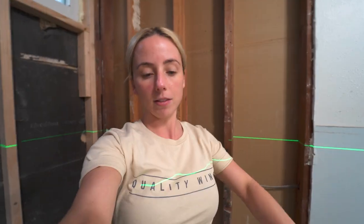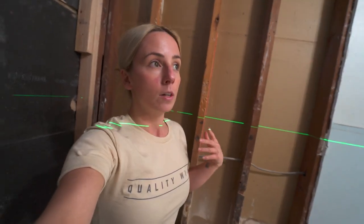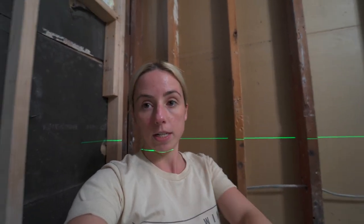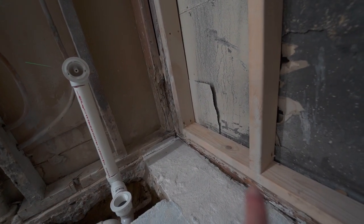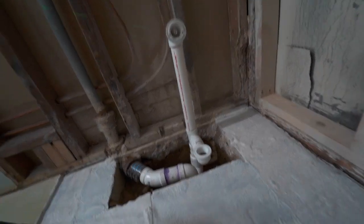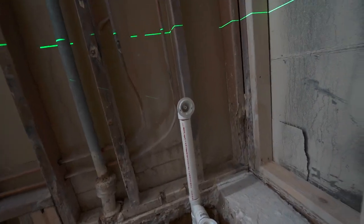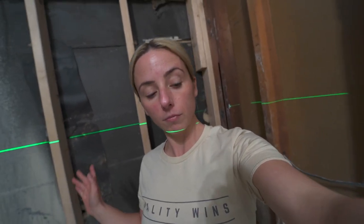The next step is to map out the area — meaning setting the height of where you're going to pour the self-leveler, so you know how out-of-level specific spots in the room are. I'll link that video below. After that, we're going to dam off the whole area along the edges and walls, because you need expansion around the entire room, and also we don't want the self-leveler going down the drain. Set your pins, do your damming, and then we can pour.